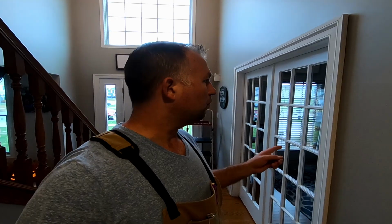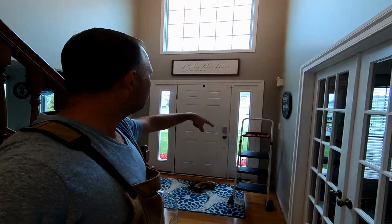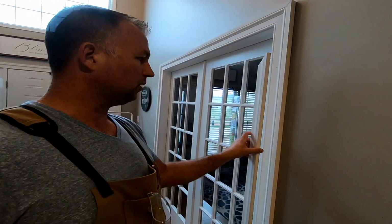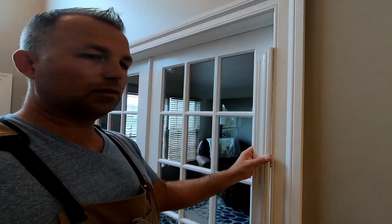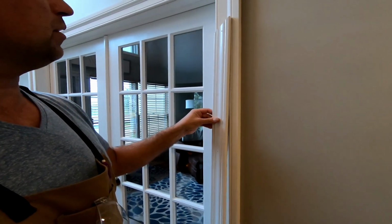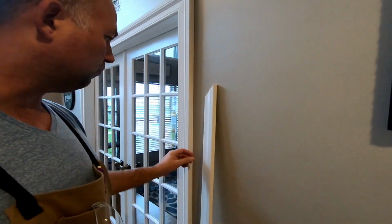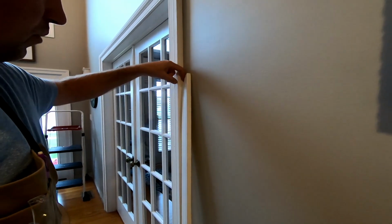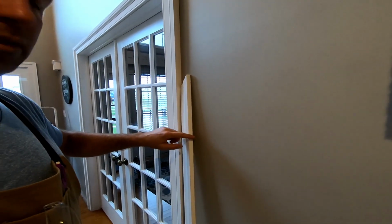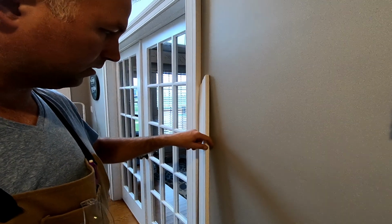The casings are up, as you can see. This door, that door. Just to give you an idea why we changed it, this is the old casing, as you can see it. Much smaller. It actually only came out to about right there. So now, the difference here is that when I put that 1x up here, you can see how much thicker it is from this. Now you could definitely use this casing, you just have to use a thinner piece of wood, so you have to do like a 1/2 inch or smaller thickness.